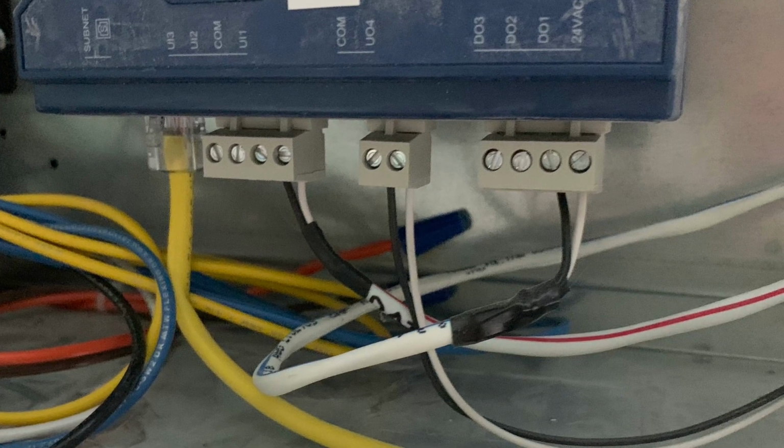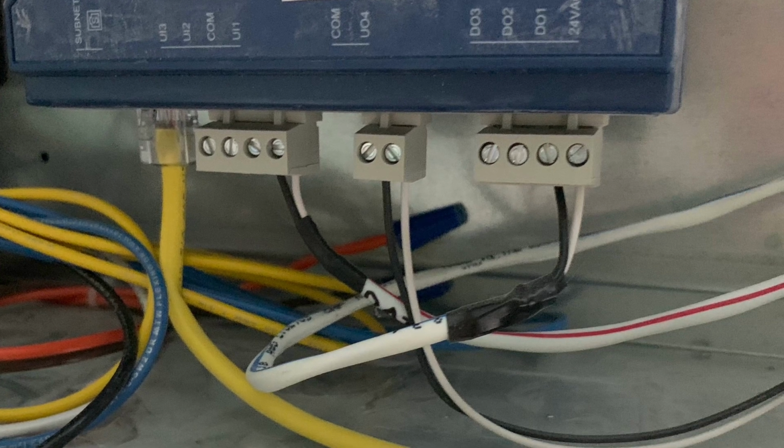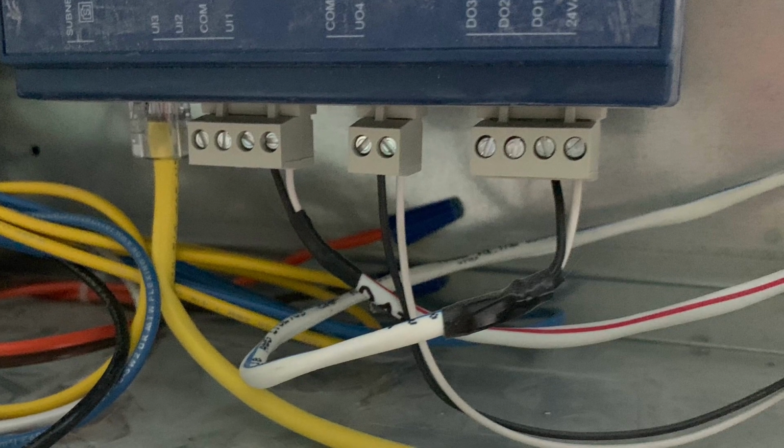This is an older picture without the new green, white, and red, black wires. The old guy ran 2-wire to these units, and they needed a 4-wire, so I had to take apart the switch boxes on top of the units and run a new wire to all of them so far. So one of them hasn't been right.